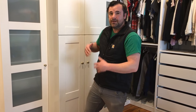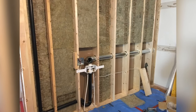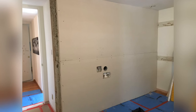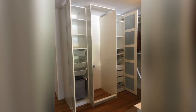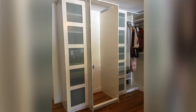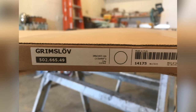I'll show you how I laid out the hinges and some of the product code numbers on the doors and the panels. Here's what it looked like beforehand — I pre-planned my ductwork so it would fit inside of a 2x8 wall, insulated it, boarded it up, did some mudding and taping, and set the cabinetry. Now it's at a stage where I'm ready to install the doors and lay out my hinge locations. Here are the 40 inch Grimslov doors that I used — I took photos so you guys have examples and part numbers.